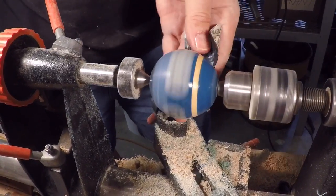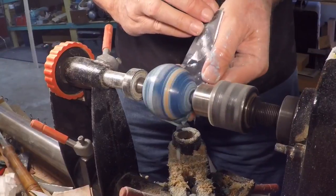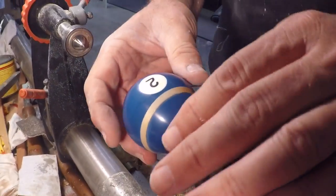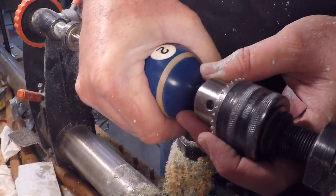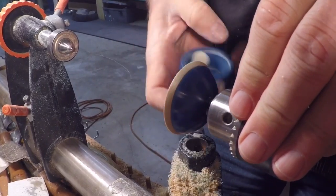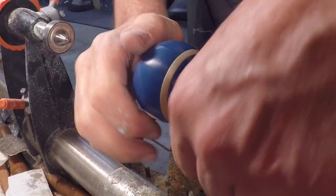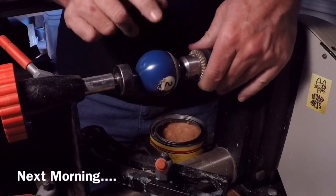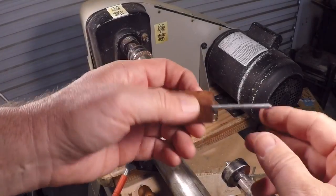This was about 180 grit. The phenolic wet sands very, very nicely and readily. We've gone through the grits with the wet sanding and it's in pretty good shape. I'm going to have to let it sit for the night — when I got the wood wet it swelled up a little bit and the grain will stand out, so I'll let it dry through the night, sand it again in the morning, and then I'll be ready to put my wax finish on. I just use good old paste wax — it seems to hide a lot of little nicks and defects pretty well.